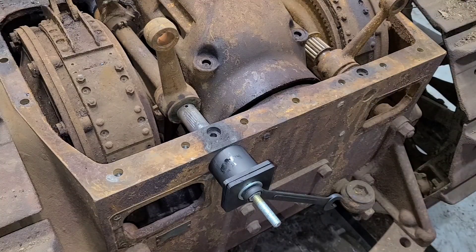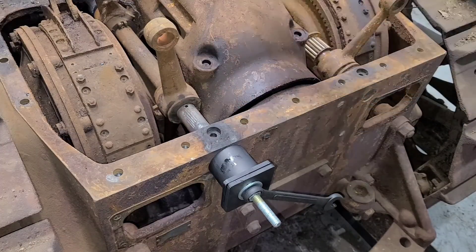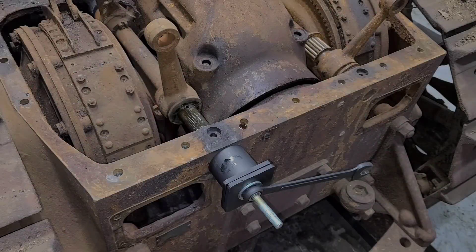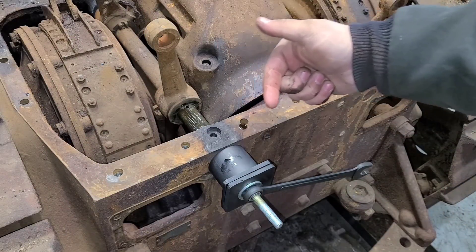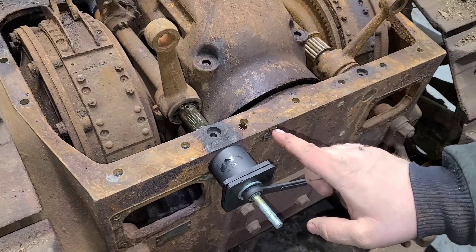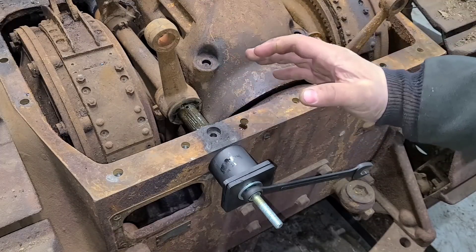It is moving, so I'm going to just put a little light coating of that same 30-weight oil on here just as a lubricant. I know everyone's going to say put penetrating oil there — it doesn't matter, as long as you have some sort of lubricant in here it'll be all right. One thing to keep in mind while we're doing this: the farther this shaft comes this way, theoretically the easier it should move. That is a blind hole down there, meaning it is not a through hole, so that just goes into that pocket. As we bring it out there's less and less material contacting in that blind hole, so it should get easier.